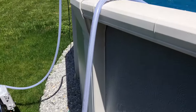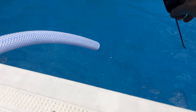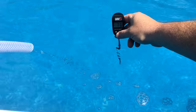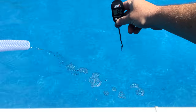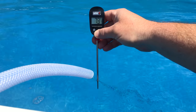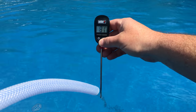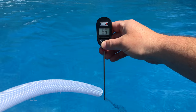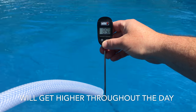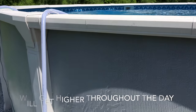Output water is coming out at about 85 degrees. The pool right now is about 73 degrees according to our other thermometer. Putting it under the output — this is coming out about 85 degrees. So a rise of about 12 degrees in temperature for your delta.